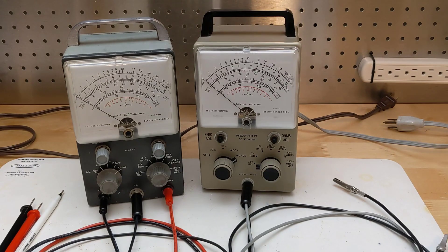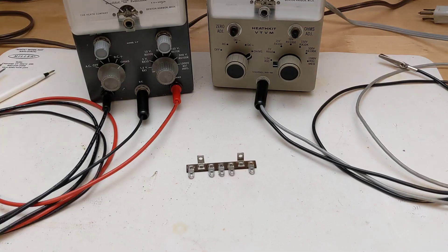I tried this circuit on two Heathkit V7 and IM18 VTVMs and found that it worked well. The limited voltage regulation is not a big issue as you need to initially adjust the zero and full scale meter values from the VTVM front panel controls whenever you make resistance readings. There was significant ripple on the DC output with the leads shorted when on the lowest ohms range, but since the meter responds to the average value, it wasn't noticeable. This circuit could be installed internally in most VTVMs by adding a 5-lug or similar terminal strip and finding a suitable place on the chassis to mount it.